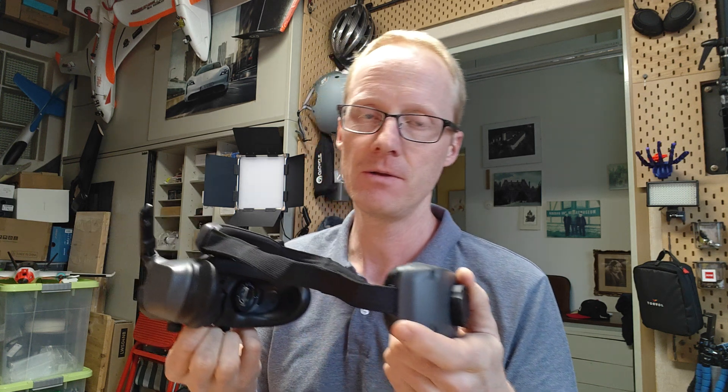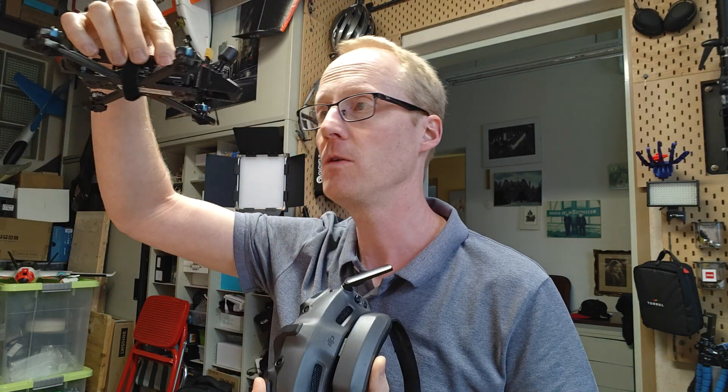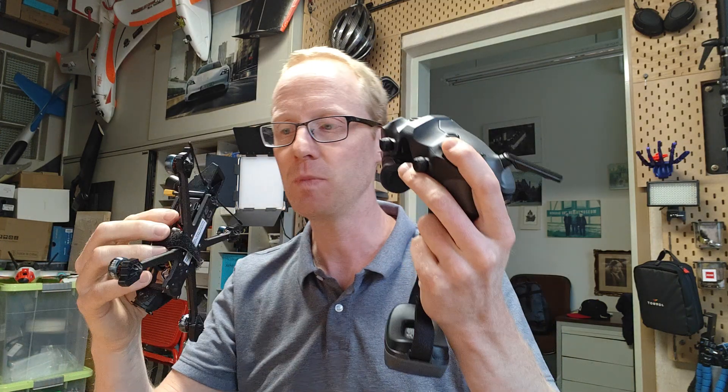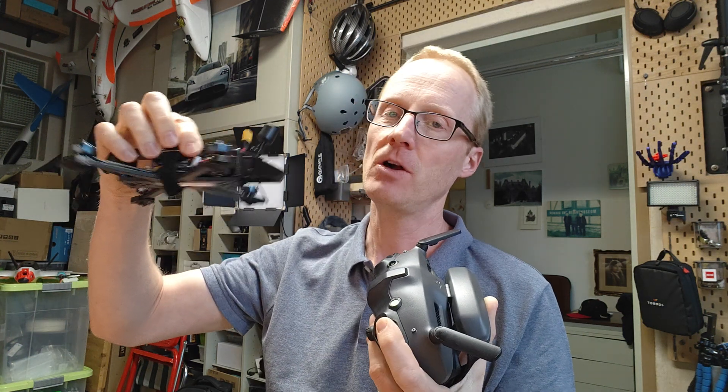Anyway, I got them and I read this nasty thread on the DJI forums where Mads Tech — hello — is also active. Apparently, after now 40 days of ongoing troubleshooting by the whole community, DJI couldn't come up with a fix to the issue that once you lose connection — whatever the reason might be — it will not get connection back even if you get into a better range situation. For example, if you fly behind a tree or even a hill, video drops out, but then most copters go into failsafe or you can trigger failsafe, it ascends, flies back, and as soon as it comes within range you'd normally see video coming back. But not in this case, because the bug seems to be that the goggles can only establish or re-establish a video connection with the O3 air unit if the copter is in a disarmed state.